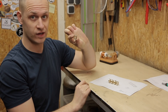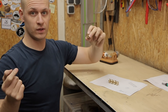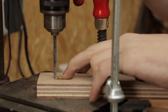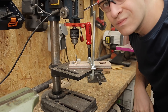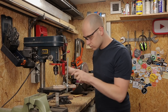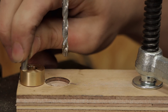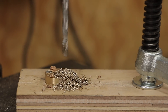Right now they're not yet a crankshaft. I need to drill some holes in it so I can put some connecting rods in between to form the offset we need for the crankshaft. To get the second hole aligned I'm dropping a pin in here and then placing it in the previous hole. That way I know the spacing is always consistent.